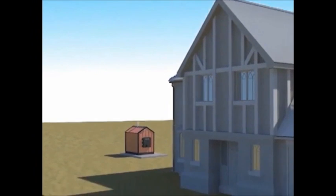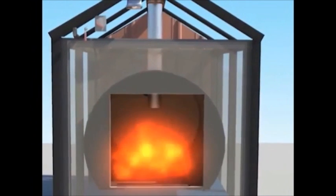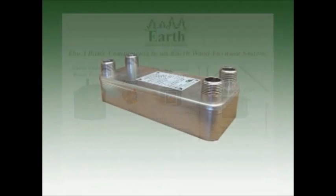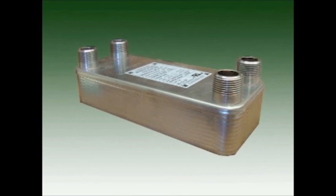Now that we've seen how the furnace is put together, let's take a look at how it can work for you to keep your home warm and comfortable. The Earth outdoor wood furnace heats up water that is pumped into your house where it can be used to heat air or water. Most homes have central heat and air — in this case, a water-to-air heat exchanger can be installed in their existing ductwork. Other homes with radiant-style heat will use a plate exchanger or other method. Talk with a knowledgeable dealer or installer for help. An outdoor wood furnace can also be used to heat your water.